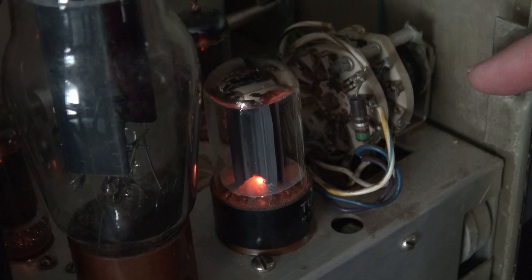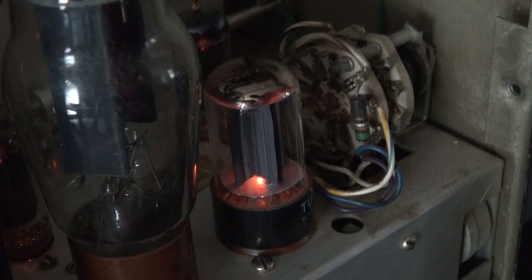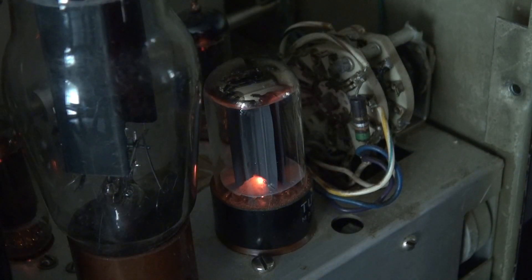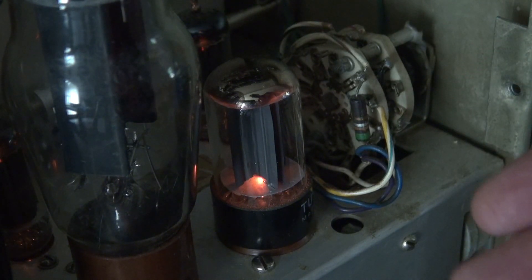Here is the rotary switch that I showed you on the front of the Ranger — this is your function switch. If you pay attention right back here on the second wafer, when I turn the switch, you're going to see some arcing. See it? Right down there. What's going on is when you're toggling the switch, you're applying a load to the power supply, so it's going to arc a little bit. And every time that happens, it's taking away little microscopic pieces of the metal on those contacts, and eventually it'll eat enough of it away to where the switch just won't function anymore.